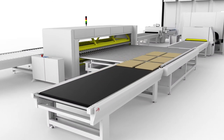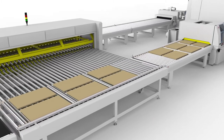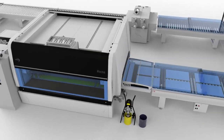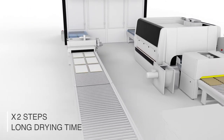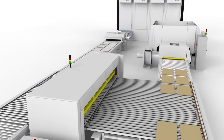The spray coating line is normally a closed-loop system carrying out polyurethane or polyester-based primer application in multiple steps on flat surfaces and edges. This cycle requires extremely long drying times since the panels must be stabilized at suitable intervals in the warehouse before the sanding and finishing processes.